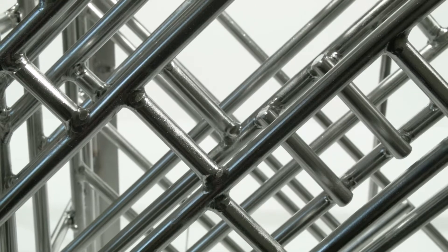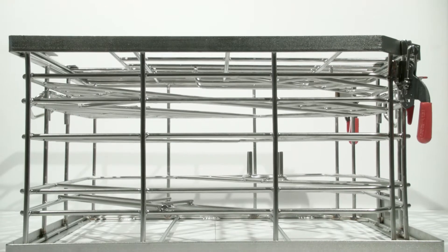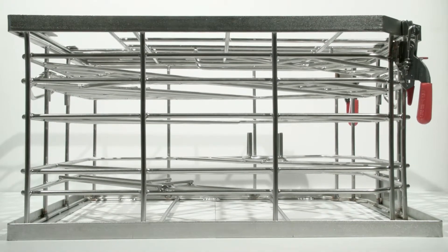When we were confident with our digital design, we downloaded the models directly to our CNC rod bender to make the parts in stainless steel rod, then welded everything together. Sample parts arrived towards the end of our fabrication process and they dropped perfectly into position.